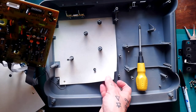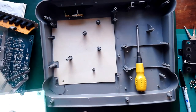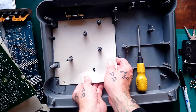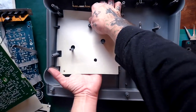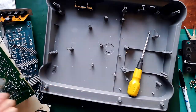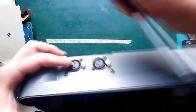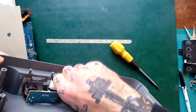You can see there's a word and a bit of shielding — well maybe not glued down, there seems to be double-sided tape or something under there. You could lay that off to the side to do any soldering, signal tracing or whatever you needed to do. I'm going to remove this for the sake of cleaning — it is coming away reasonably easily, just double-sided tape really. I can put it back with a little bit of carpet tape to keep it held down. The only other thing still attached is this XLR input daughter board. There's some tape over it here — maybe that's a conductivity thing — so I may need to replace this tape when I put it back.